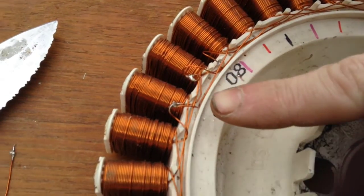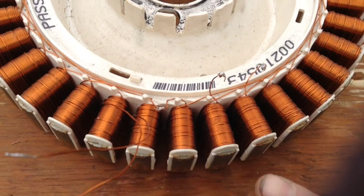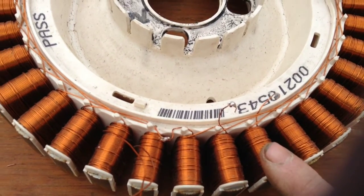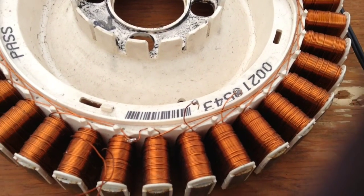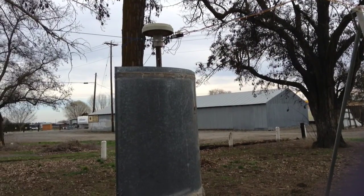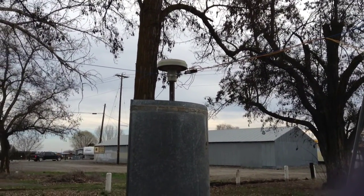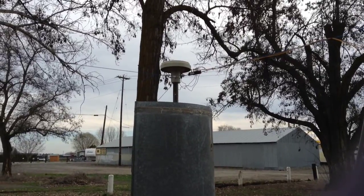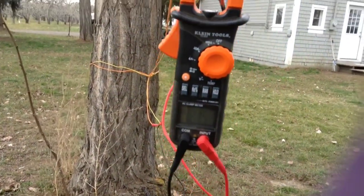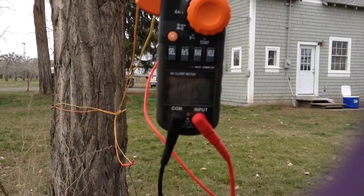On the stator, you can see I put these back together in series. I'm on my second one - once I get these two soldered back together I'll be back to the way it was from the factory. I got it rewired back to factory, hooked the bridge rectifier back up with the clip leads, and we're hooked up to our battery. We've got a voltage of 12.15 volts.